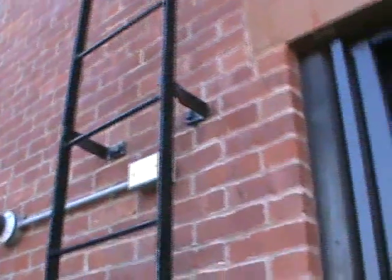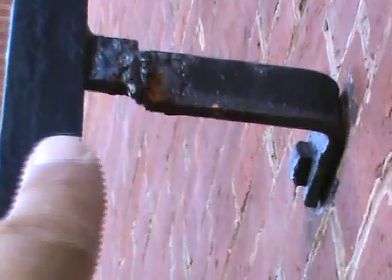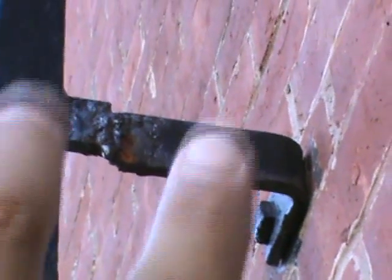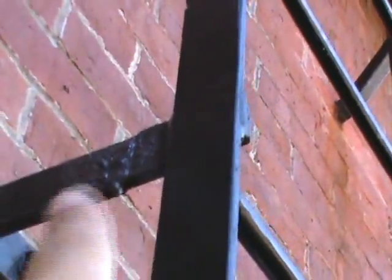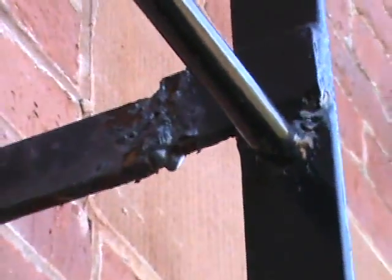We have welded connections that came in, with very poor connections here, as you can see. Some of these welded connections are now suspect, so what we need to do is sister that and put in a couple of bolts. As soon as we put in some bolts, we can eliminate the need for either x-ray or load testing of that connection. As you can see, some poor welding on that one also. Once we sister that with a bolt, a bolt here and a sistering there, that will eliminate that need. But as you can see, the water gets into these welds and makes them weak, and whether or not they'll last 5 years is suspect, okay?